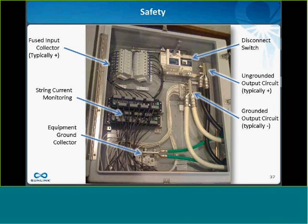The next one below it, the grounded conductor, is it safe to touch that? Well, in theory, yes, it would be because that's grounded at the inverter. But in practice, because there's a voltage drop between here and the point of the inverter, and because I don't know if you really feel lucky that they've properly grounded at the inverter, I would never recommend touching this conductor either. The ground tends to be safer, but again, proceed with caution.